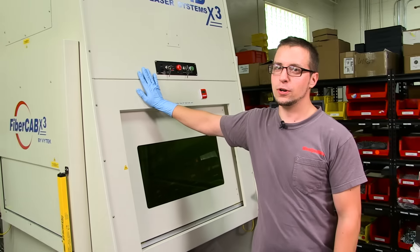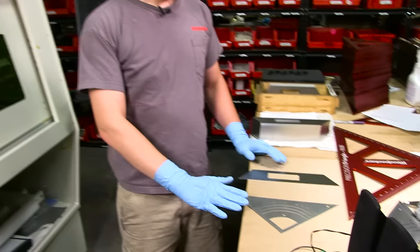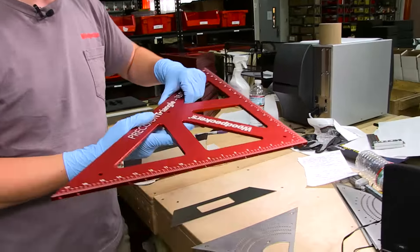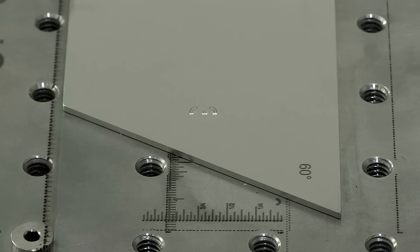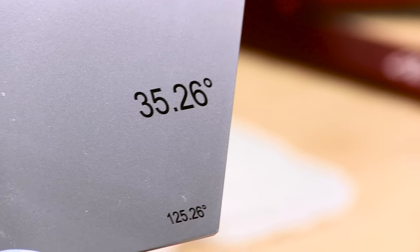Right now I'm setting up one of our state-of-the-art fiber lasers to run both the 4590 stainless steel triangle and the Blade Gauge. Both of these parts are a little more difficult to mark because instead of engraving them like we do with our anodized parts — which removes material and creates a layer of oxidization — we will be annealing them, which uses the high localized heat from the laser to pull the carbon to the surface, creating a high contrast mark.